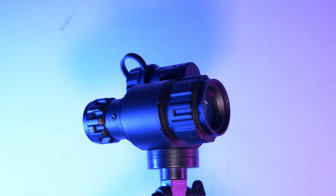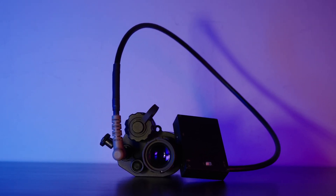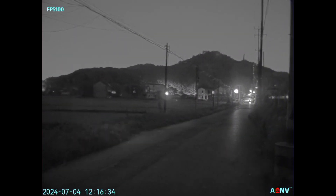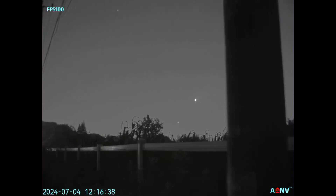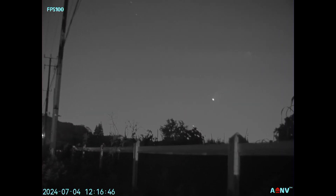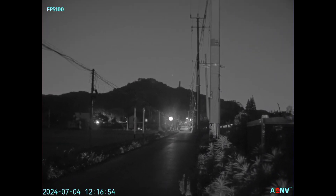Let's segue into the ADNV G14P2's video recording solution. This is the ADNV RS2, a digital video recorder that captures the video out signal from the ADNV G14P2's 9-pin connector socket. It captures the full 800x600 resolution of the unit at either 100 or 50 frames per second depending on the mode set. It records at 8-bit color depth at 4:2:0 chroma subsampling using the H.264 codec, which also uses IPB video compression. This gives decent enough video quality for recording footage from a nod, but issues arise in extreme low light when video signals approach the noise floor. The IPB compression combined with low-for-industry-standard bit rates has a nasty tendency to crush the signals into the noise.